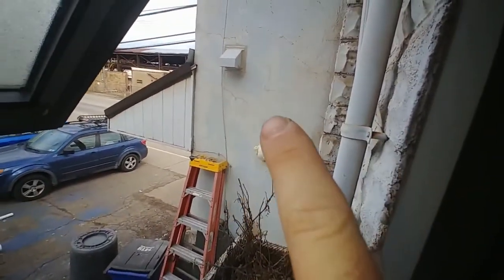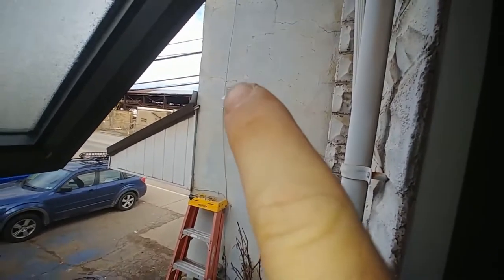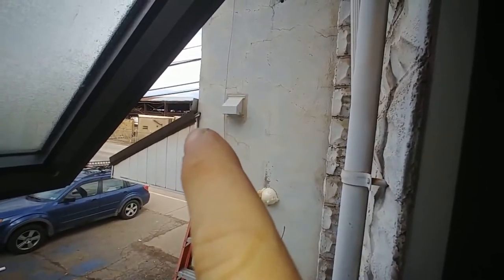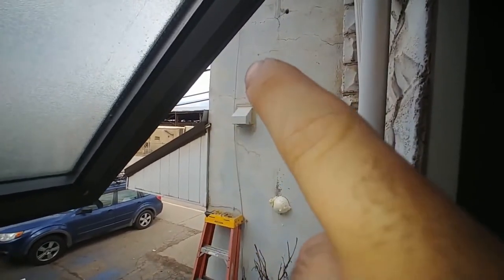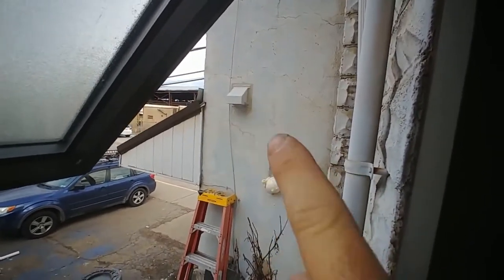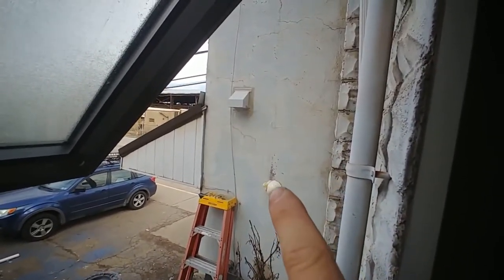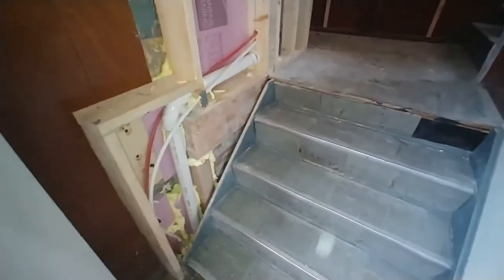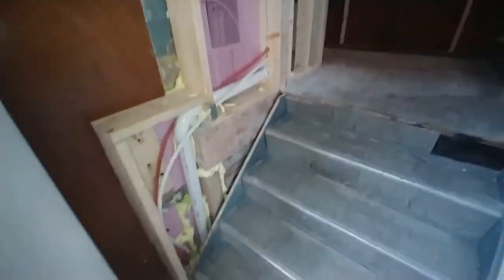Now on this wall, this is why we came out this wall, because I couldn't be any higher than that, and if I was that high around on the face above the door, I would have been in the roof segment there. I would have been wanting to be at least another foot higher up if I needed to come out of that wall. So we had to come out over here anyway. I made a nice big hole into the core of the blocks here before I realized it, so I backed it up and filled it through full of foam. First and only big goof on this project.